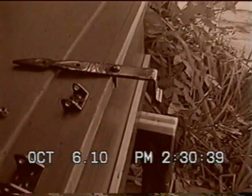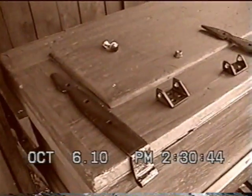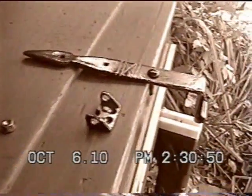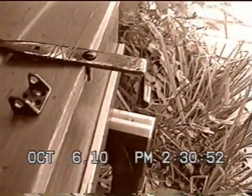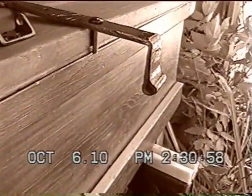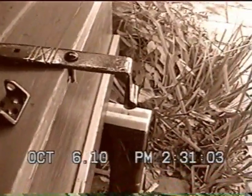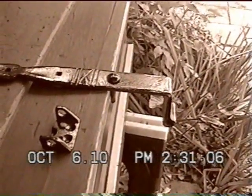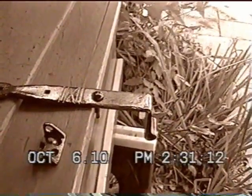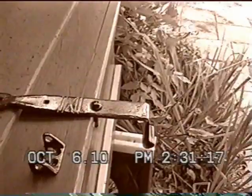These strap hinges have forged welded eyes, and they go on top, and I got square holes for mounting. I used carriage bolts and cut them off the right length so I wouldn't have many threads on the back side of the nut going through the trunk lid, so it won't be catching on nothing. On top, the carriage bolts make it look like big rivets, and with the square holes and the square shoulder on the carriage bolts, it enables me to tighten the nut up without the head of the carriage bolt turning.